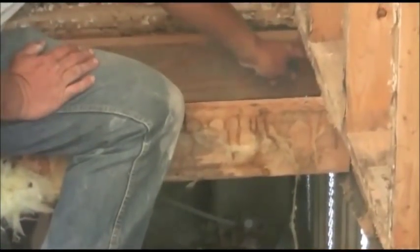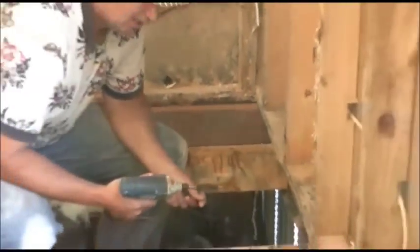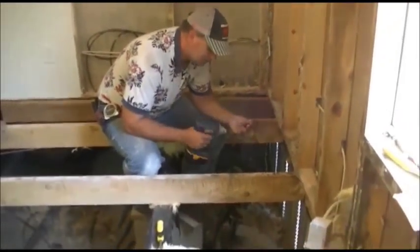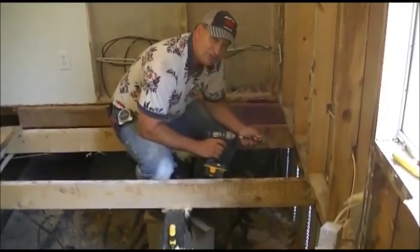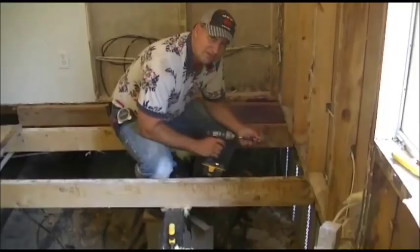Floor, and I'm going to put on top of the frame, which is right here, and connect it to the joist here. And I'm using an impact gun, which is available. You'll hear the chattering. What it does is it constantly pushes that screw tip down into that screw, and it helps you stay in it. Now you still may have to feather it in from time to time.